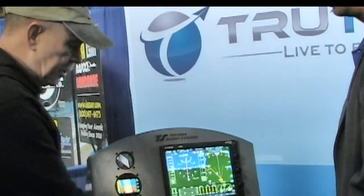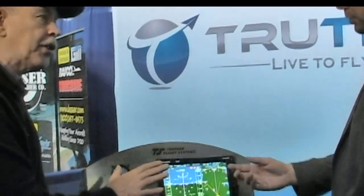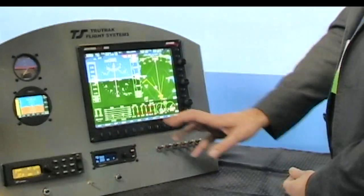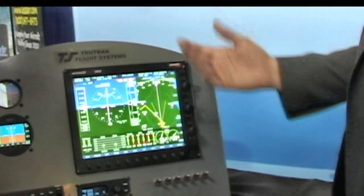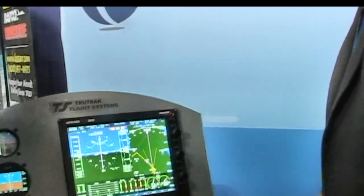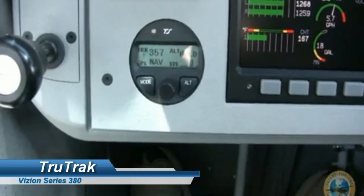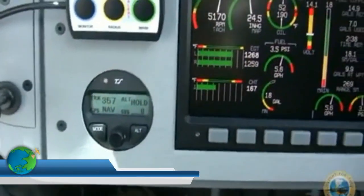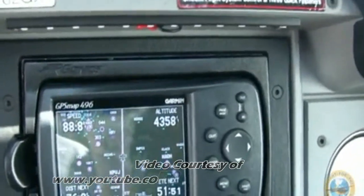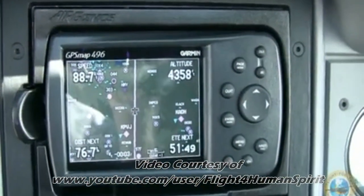Now you're controlling this — you're doing some of the controls right here. But you can also control this through the screen, to some extent — the use of the autopilot, I mean. Absolutely. We've got a really neat integration package here with, as we're showing, an Advanced 5000 series EFIS. So the autopilot not only is fully capable on its own, it also can follow anything you program into the EFIS. If you want to follow your heading bugs, your altitude bugs, or even your pre-programmed flight plan in the GPS, the autopilot is fully capable. So you just adjust the screen.